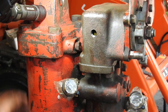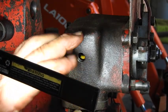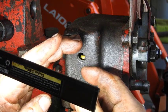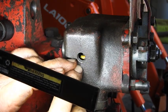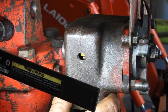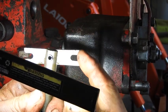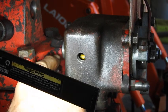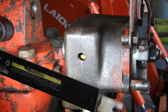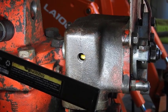So now take a look inside here. I was able to depress it down and use a thin flat screwdriver stuck into the top of the hole to hold it in position, with my flashlight set right here. Then I was able to take this and slip it in literally in three seconds. I could watch it match up and engage perfectly because I'd painted the end of the stem yellow, and you can actually see inside and now it's moving back and forth. Moving this side of the hydraulic control — now the draft control is attached to the other side, and you can see it — that's this little aluminum arm right here that was broken and I had to change to the new one. So that's pretty much it. I'm going to put the pipe dope and everything on the plug, put the plug in, and then we're going to go about the business of installing this back on the tractor.